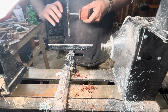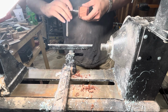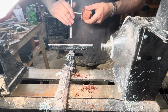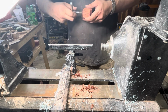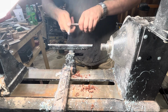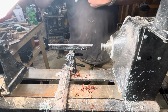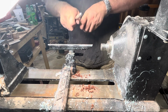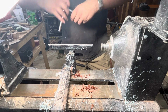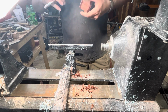And I don't do this exactly perfect, but my results, I've never had too big of an issue other than sometimes the wood gets a little too soft and can't actually hold a thread. And when that happens, I have some inserts that I can drill this hole out, pop the thread insert in, and if it's something that you've already bought and it fails, or something doesn't hold right, I can always get it back to my place, drill it out, glue in a threaded insert, and then everything is fixed and she's ready to rock and roll again.